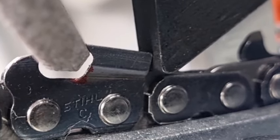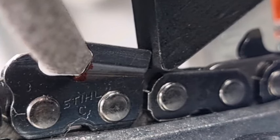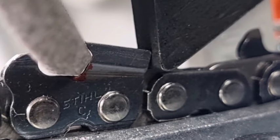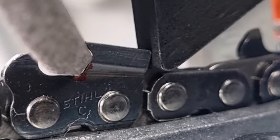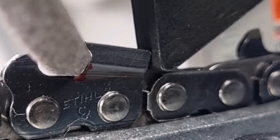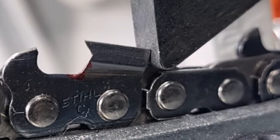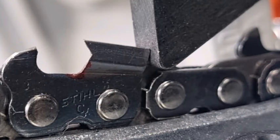I've got the wheel in the tooth and you can see a few tiny gaps there. If I tilt it another five degrees, that's going to be interesting to see. We'll tilt another five degrees and see which one matches. There's not much in it — a couple of degrees — but there's either a mistake in the Stihl USG chart for Hexa, because the top plate cutting angle is stated as 25 degrees.